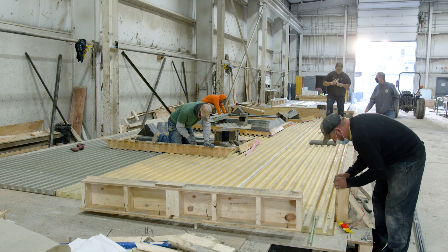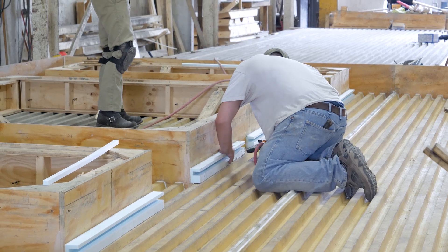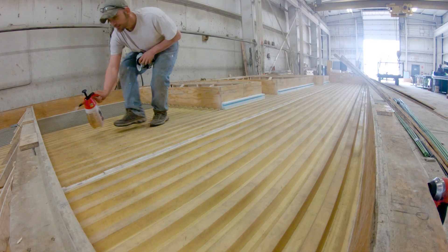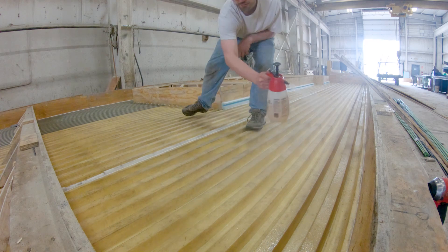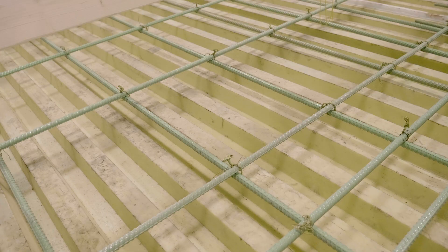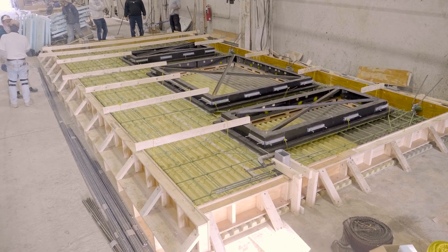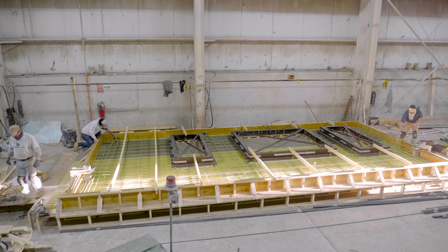The fully cured rubber liners are placed on a casting deck and form walls are built to contain the concrete. Other forms and knockouts are positioned for the windows and sills according to the architect's drawing. A concrete form release is evenly applied over the entire mold to assist in demolding the concrete casting. All areas the concrete will come in contact with are sprayed thoroughly, including the wooden form walls. Steel rebar is placed within the form over the rubber liners; the rebar will act as reinforcement within the concrete panels. Compressed air is blown on the liner and a shop vac is used to clean any dust or debris prior to placing the concrete.